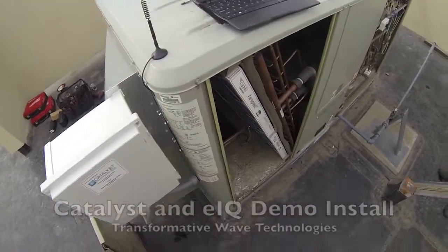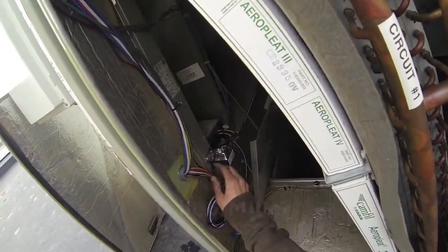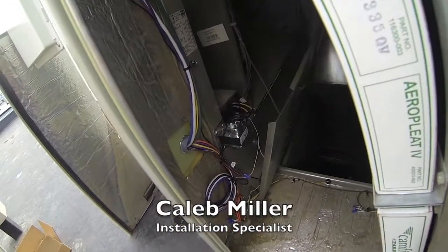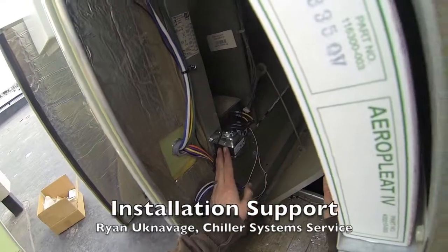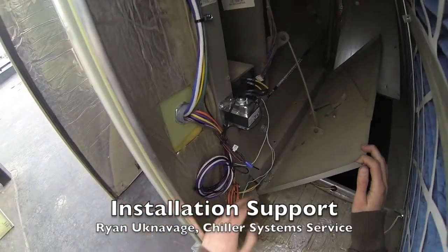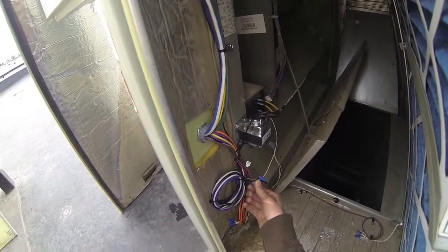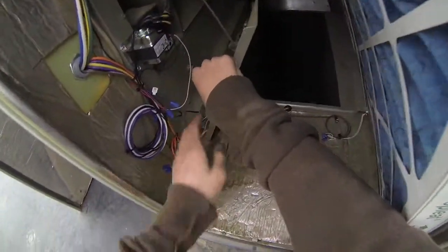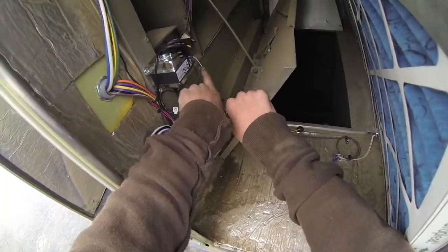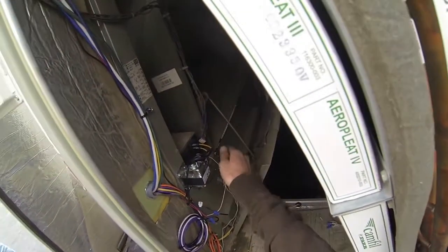After we get the box mounted and run our outdoor rated conduit through, we're able to wire up our economizer that's connected to an isolation transformer. It gets wired up to a green-purple three or purple three-conductor — red going to the hot side, black going to common, with a jumper into the negative side of our adapter card, and white goes to the positive from the green three. Then we power it up from the transformer.